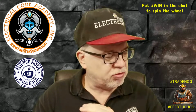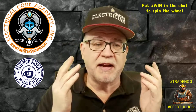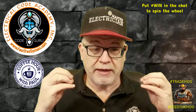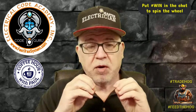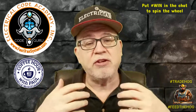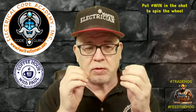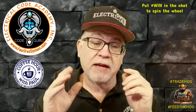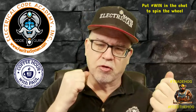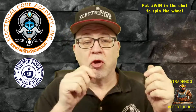So basically, the easiest way that I explain paralleling and what we're trying to do is the same way in a stranded conductor. You have a stranded conductor, let's say a 500 kcmil, right? You have these like 37 strands or whatnot in there. Well, they're all acting as one, even though they're separate individual strands. But when you connect them together at both ends in a single conductor, it acts as one conductor and you're getting a certain amount of ampacity out. But each individual strand is distributing the current equally, right? So when you think of that same concept and you have multiple sets, it's the same thing, right? You're connecting them at both ends so that those multiple conductors per set or per phase, A, let's say, are acting as one conductor.